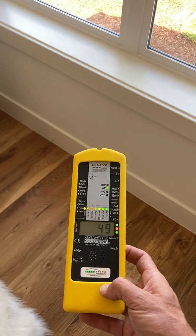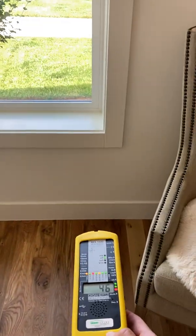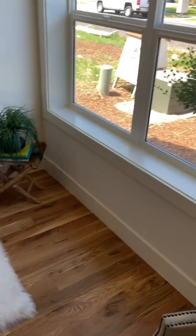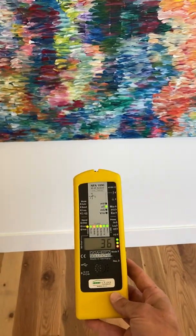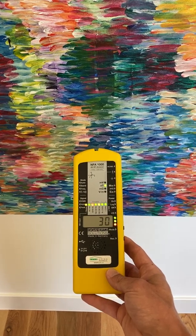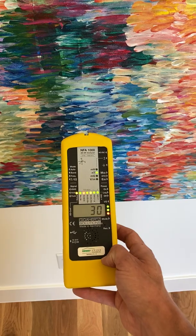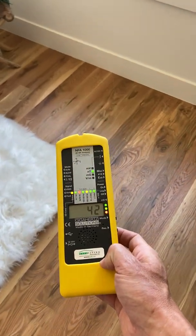In this case, it's just kind of a corner of this room, so that's good news. This will also inform you as to use of the actual room — we wouldn't want to put a bed, a desk, or anything along this wall. We would probably want those things to be over on the opposite wall, where we're down very close to that lower end of 0.2 milligauss. That's kind of how I look at pad mount transformers. Give us a subscribe, and if you have questions or comments feel free to leave those below and I'll get back to you. Thanks.